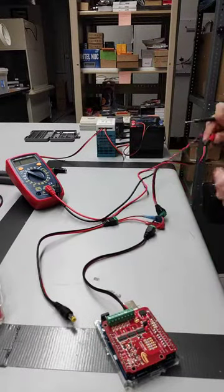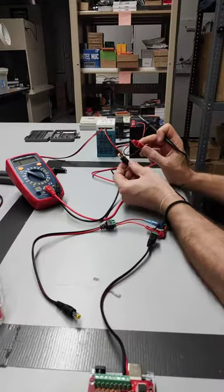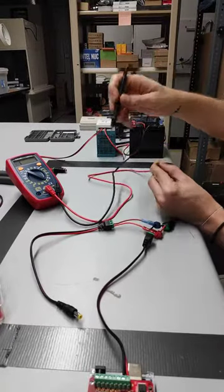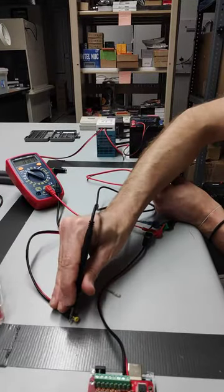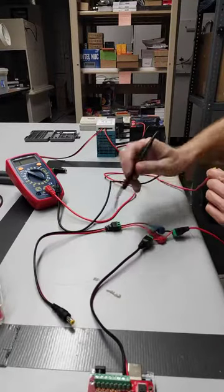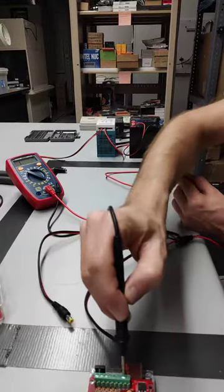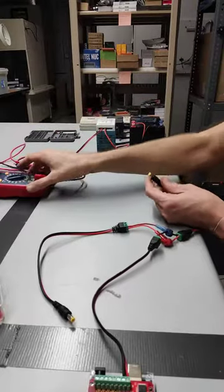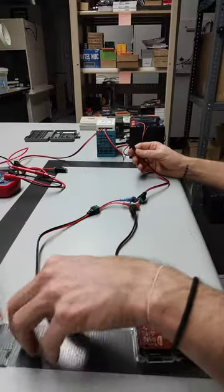So, perfect. Then on the outside, now again, remember for continuity testing, it doesn't matter the color, it's just if you're touching. So now I'm testing ground on the outside here, on the negative side after the split. Perfect. And all the way in the board. Okay, so we've got some continuity testing, so we know that things are at least connected up correctly.